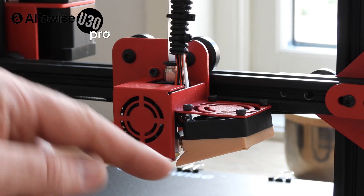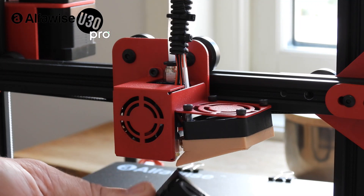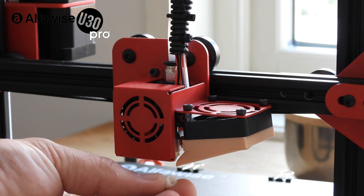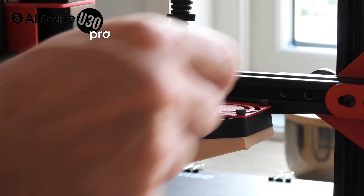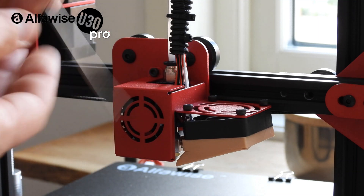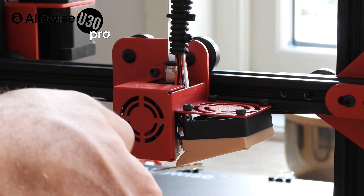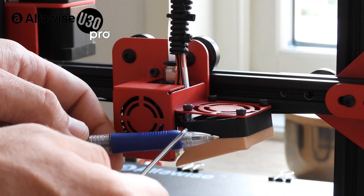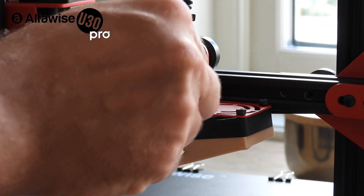I pre-made my own filament cooling duct because I don't like the original. I removed the four plastic spacers and added two springs, so now I can reduce the angle on my filament cooling duct. I just use those two pen springs, one here and one here.